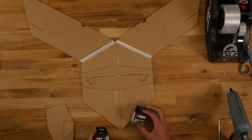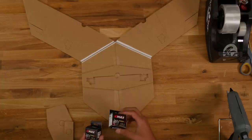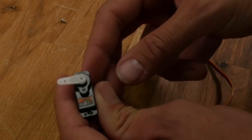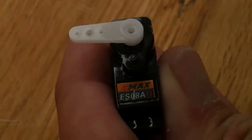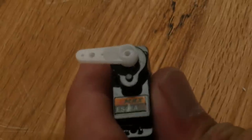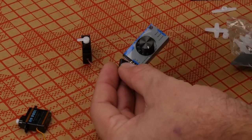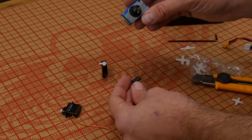Flip the bottom piece over and line up the two top pieces face down on the leading edge so the two bevels are lined up next to each other. Take a piece of packing tape a little over what you need, put it right up against the other piece, lay it down smooth, and trim the excess off with a razor blade. Do the same on the other side. Put the tape on one side first, then let the tape flap peel up a little so you can tack the bottom of the tape onto the other part before making the final decision to lay the tape down — this ensures proper alignment. Now flip this over and install the spar, which is in three pieces because the outside of the wing is very slim while the inside is fairly thick — three pieces of foam thick. Pop out the tabs and make the spar. The small circle in the middle should be pointed more forwards. Pop the spar down, lining it up with the etch marks, and smear the glue around a little bit. Before putting the other spars on, take the servos, center them, and install them.